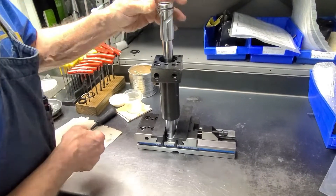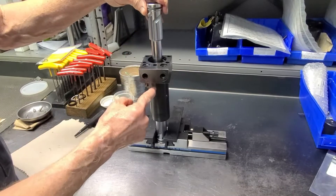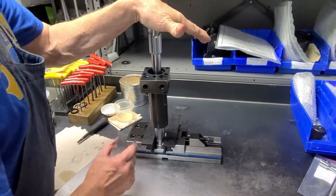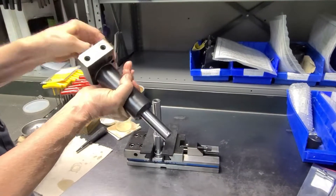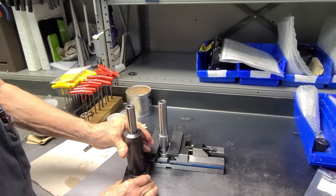Place the plunger onto the old plunger and line up the cam groove with the ball in the body. Place your hand on top of the swing clamp plunger and pull the body up, extending through the swing clamp, and then push the plunger in place.